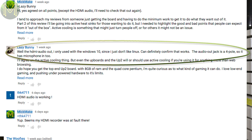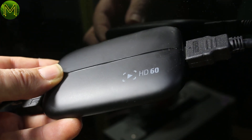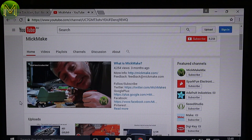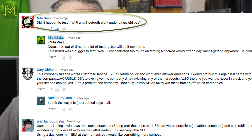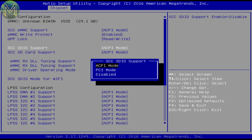Moving on to HDMI audio — Lazy Bunny first mentioned that HDMI audio was actually working, but for some reason it wasn't for me; it never came up as an audio device. It seems that my Elgato HD60 1080p HDMI recorder is having problems passing through HDMI audio, odd as it was working before. So back to directly connecting it to my display and using a camera to record it all — yep, works okay. But of course, still not working under Linux. Nita wanted to know whether Wifi or BLE was working under Linux; however, it didn't work for me under Debian. There's a great post on the LattePanda forum where someone has managed to get Wifi going, which is a simple matter of fetching the firmware and modifying the BIOS settings, but I'll need to revisit this as it wasn't working for me.